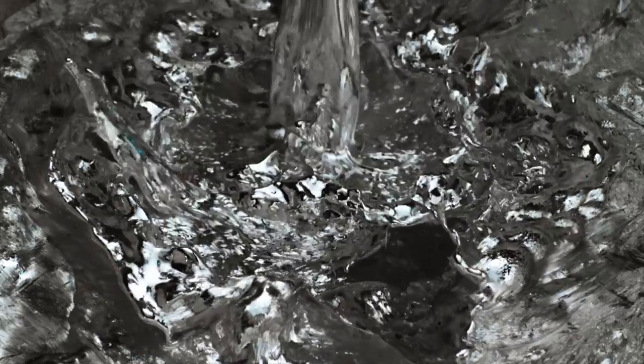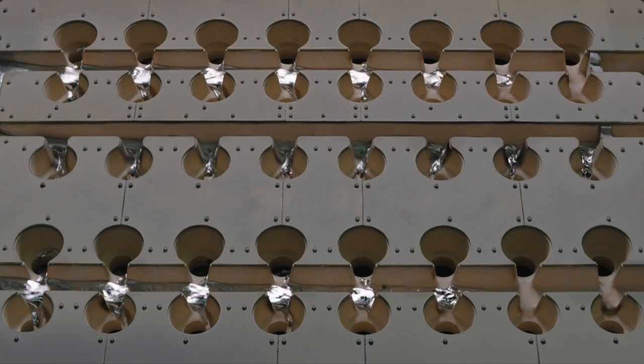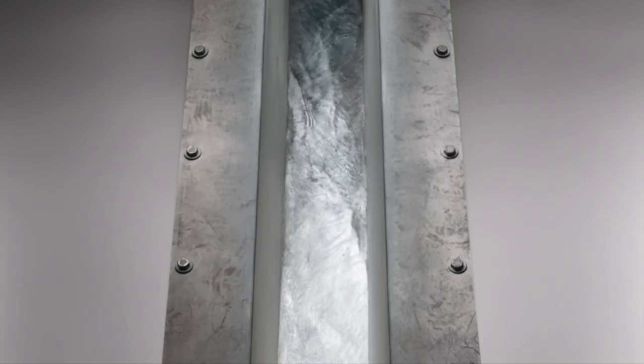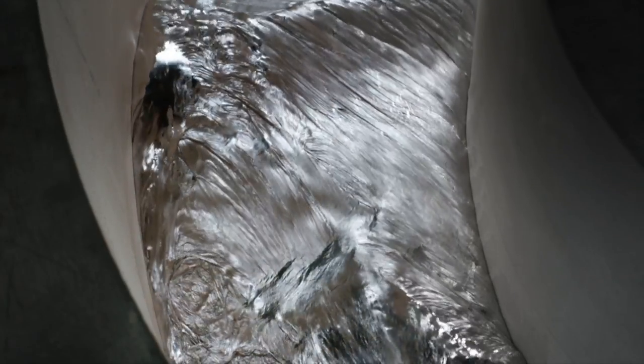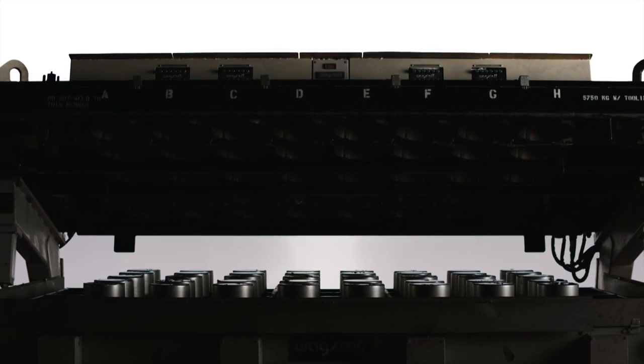This requires precision alloying. Raw aluminum of exceptional purity is first heated to a molten state. Tightly controlled amounts of magnesium and zinc are then added. As these elements bind together, they form a protective compound that strengthens the metal. The alloy is then poured, jet-cooled, and cast.